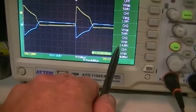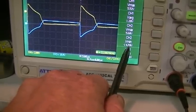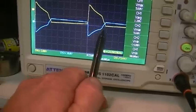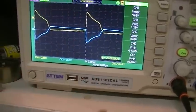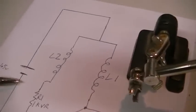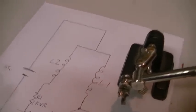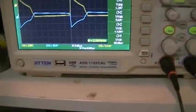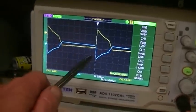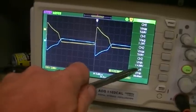We have, as I said before, 14.8 volts — well, not the emitter and base, but across L2 and the negative side of the battery when the transistor switches off. So that is not the voltage on the base; that is the voltage across L2 and the battery during the off time: 14.8 volts.